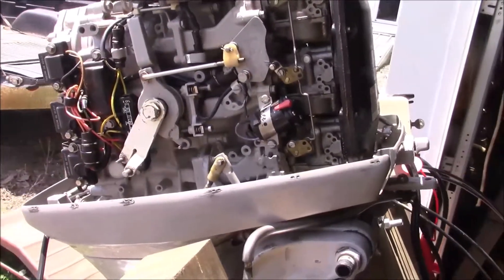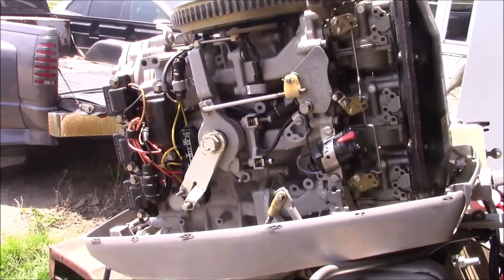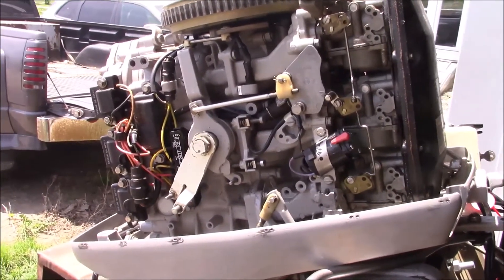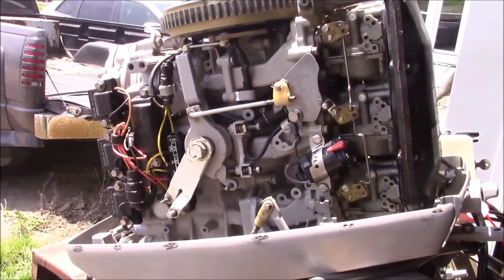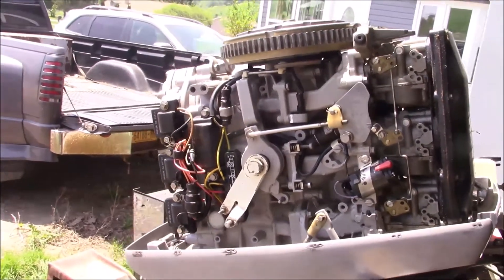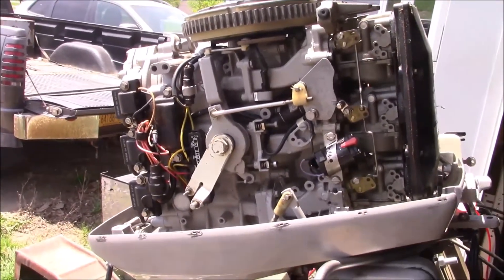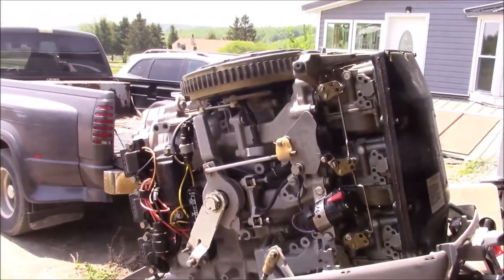That's a pretty substantial rattle. It could be a reed valve, but I really doubt it. I'll pull the carburetors and look, but my guess is probably the piston skirt slapping or the rod bearing failing on the connecting rod, or hopefully not the crank - but the crank may have had a problem. So that's a death rattle. This is 2.0. We're going to tear into this one and see if we can make it run.